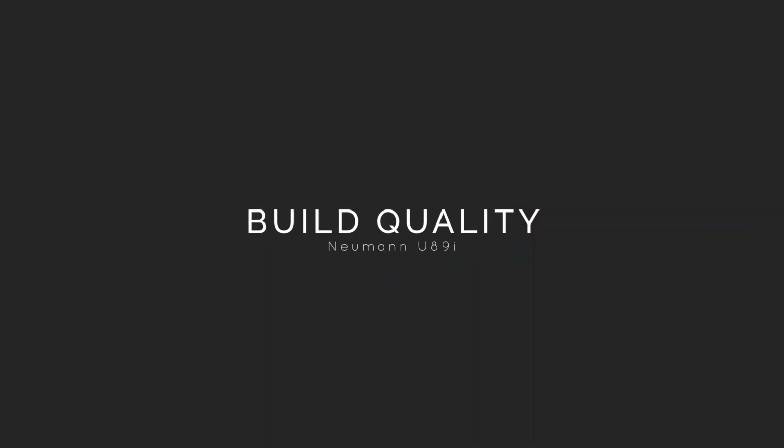It can handle higher SPL, and it has a more flexible low-cut filter. It also expands on the U87's polar patterns, adding a wide cardioid and a hypercardioid to the arsenal. And this thing is marketed as a universal studio mic, meaning it will basically sound good on everything. Now that said, the U87AI already holds that crown, so this one kind of split the audience, and it never really took off. From a build quality perspective, this thing's solid.